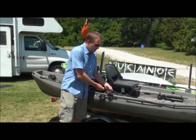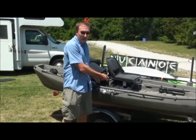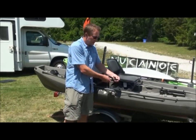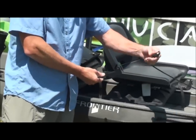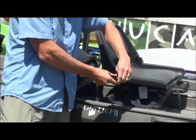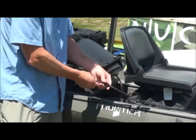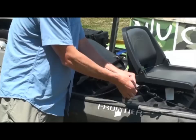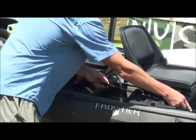When the hardware is installed, one end of the rope is fed through the deck ring, through the pad eye, and back through the other deck ring. That's then tied onto a clip that snaps right onto the two-inch plastic ring. On the other side is an adjustable knot that lets you control the length of the rope to get more or less slack, depending on how you're using it.